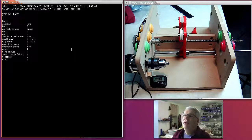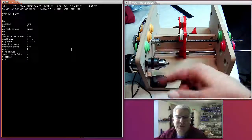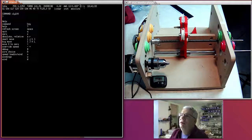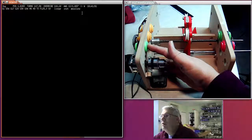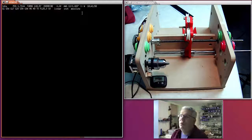You can also completely manually wind a transformer on here just using the green button, which does the synchronized move. You can change the speed at which the synchronized winding runs. There's an 'L' indicator on the screen that stands for lead-in — you can toggle between lead-in speed and wind speed. When set to 'W' for wind, the spindle goes a lot faster. The X-axis travel per rotation is set by the wire gauge.